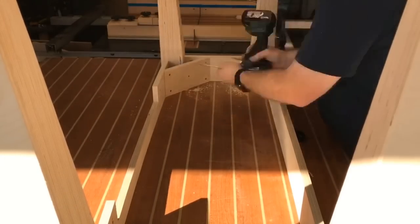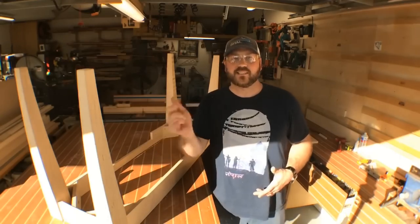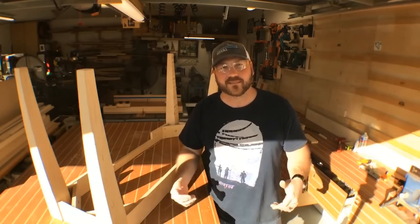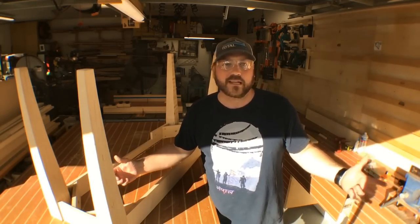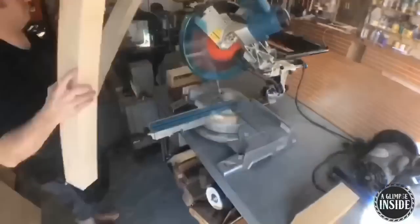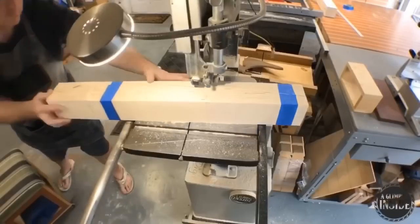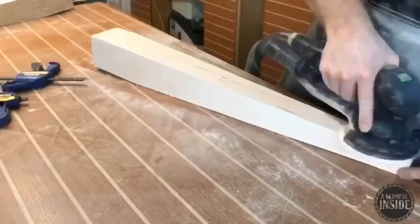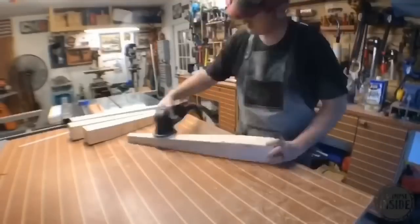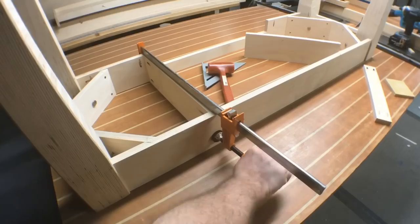This is by far my favorite and preferred method to install legs on any table — it is a very super strong hold. Quick note about these legs: I made them in a previous project. I thought I was going to make an entry table with a slab, but these legs were way too big, so I used hairpin legs for a coffee table for my kids instead. These legs are linked below. Here's a quick overview on how you make tapered legs: take Baltic birch layered together to make four-by-fours, take an angled cut on the bandsaw, reattach that piece, turn it 90 degrees, take the same angle cut again, and you've got yourself a tapered leg. Repeat on all four sides, a little sanding, and you're good to go. Check the link below for more detail.